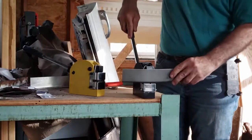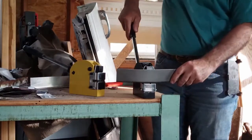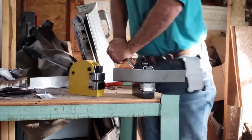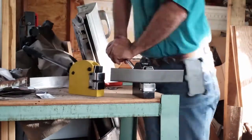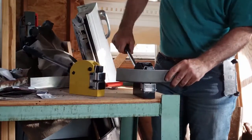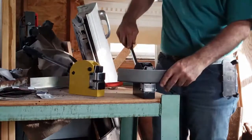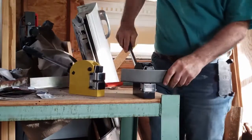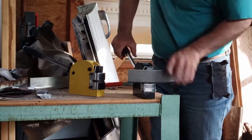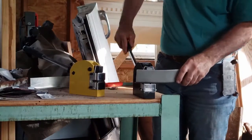When you're shrinking the metal, it depends on which direction you want it to go. You don't want to move it too much — move it in quarter-inch to half-inch increments depending on how tight you want to make the radius. If you're doing a big panel, you can space your passes three-quarter inch apart. But here I'm going to make a nice tight radius.